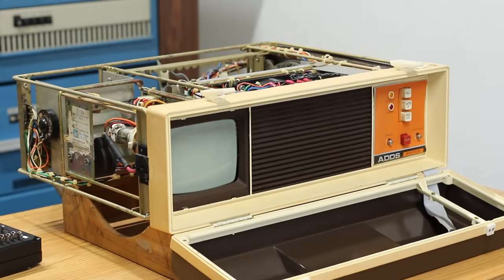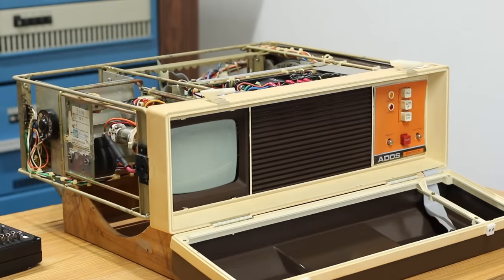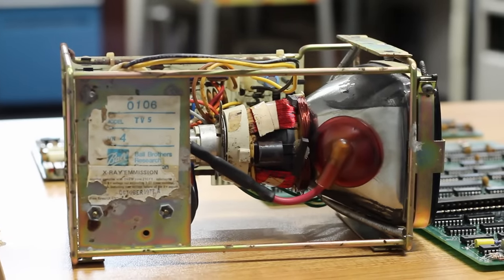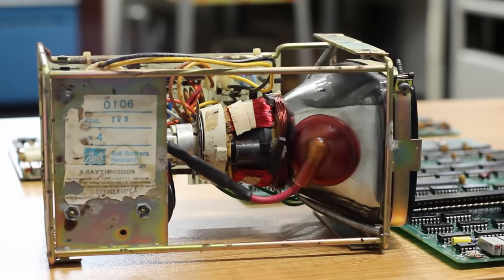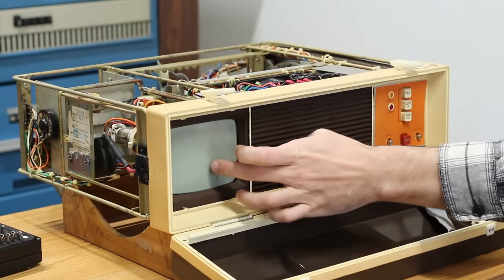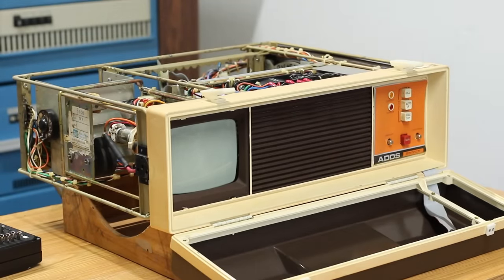What I have in right now is just the CRT. None of the circuit boards are in, so we're not risking any rare ICs. Everything else is just a discrete component that I can order with the exception of the transformers. All I'm trying to see is if it'll generate some high voltage. If we get high voltage on the CRT, maybe that's a good sign.